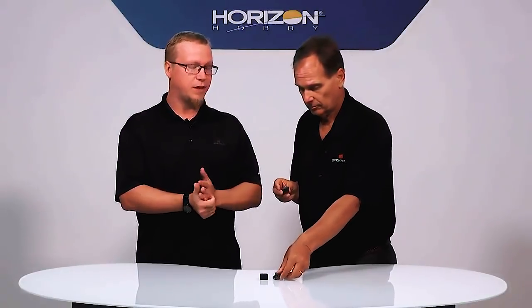Talking about sailplanes — it's got two failsafe options: preset failsafe and smart safe. Smart safe is for throttle only. The way smart safe works — and this is in all of our various receivers — if you power the receiver up, there is no output pulse on throttle, so you can safely arm your speed controller. When you first turn your transmitter on and the receiver is already powered up, it will output the pulse appropriate for the position, then you go to low throttle to arm your speed controller. If you lose signal, it will go into the failsafe position and basically kill the motor.